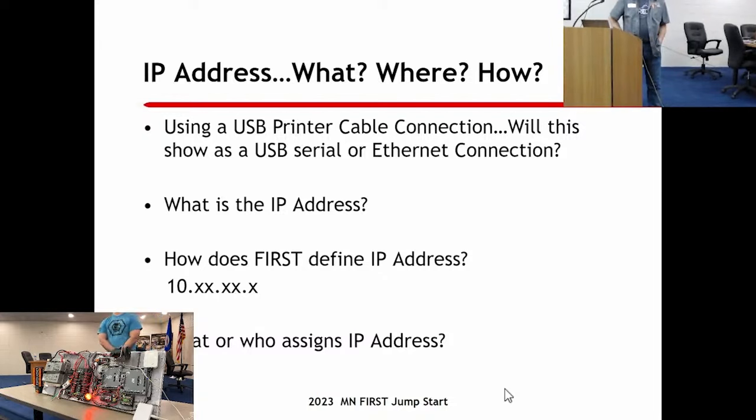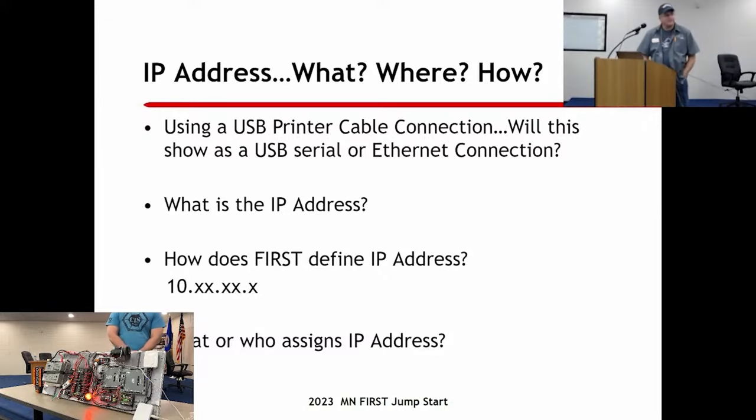A quick overview of IP addresses: the network devices on your robot talk together - it's how the radio communicates with your RoboRio, how your RoboRio talks with your laptop and the field, and how network devices like a Limelight or Raspberry Pi connect if you have a network switch for additional Ethernet ports. The whole robot follows the IP addresses handed out from your radio based on your team number. So if you're team 4607, it's 10.46.07.1, .2, and so on. The RoboRio is usually at .2.